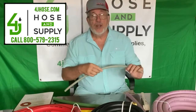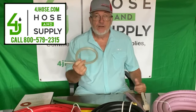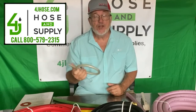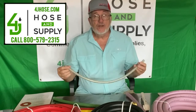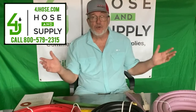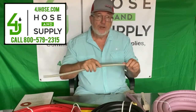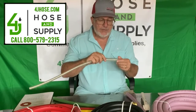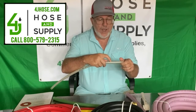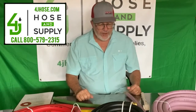Another product is the clear braided hose. This is very popular in pest control today. It's a lower PSI, lower cost, lighter weight hose at 300 PSI. We carry this in rolls of three-eighths and a half inch, and we also sell it by the foot in three-quarter inch and one-inch sizes. You can use it for suction line or shorter applications. This is a piece of three-eighths — very good quality. You'll see in a couple of other videos how well manufactured it is by the proper spacing of the thread within the hose itself.